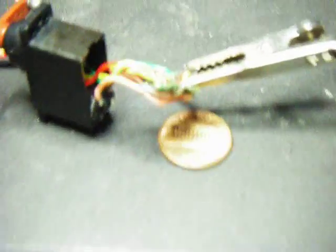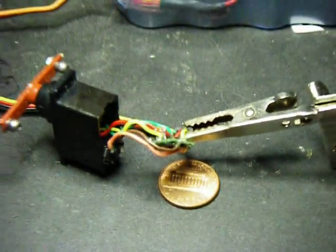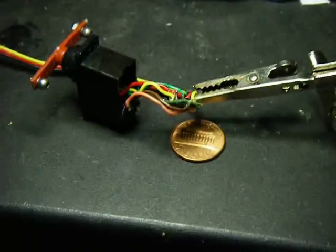That allows you to have more range, or use the entire range of the potentiometer. And before you ask — no, you can't go past 180 degrees based on how the position sensor potentiometer mechanics work out. To go more than 180, you have to either replace the potentiometer position sensor, or you would have to do another mod.